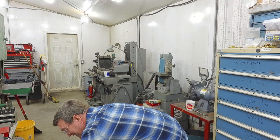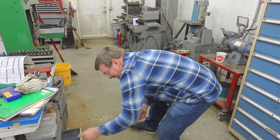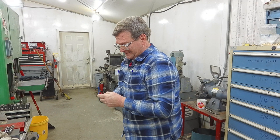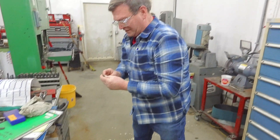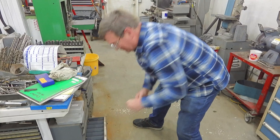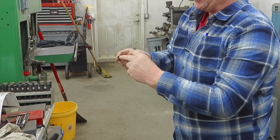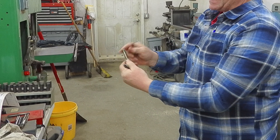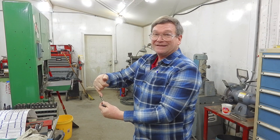It's also good to have left-hand taps. We have most of a set of left-hand taps here — same as right-hand, they just happen to be left-hand. With a spiral point tap you can immediately tell which side it cuts on: the spiral point only cuts on that side as it drives forward. This is a left-hand tap — you can see the incline going left-handed. A spiral point left-hand tap, which is very rare, would have the spiral cut on the opposite side.